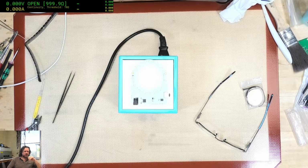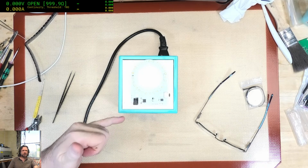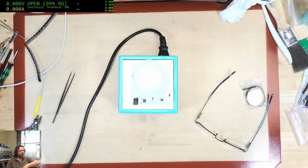Yeah, most plastics. Actually, I can't think of anything off the top of my head that is not reflow rated. But if you take your hot air wand, even at say 250, and you focus it on one of the corners, then yeah, that will melt. Consider it like this, it's equivalent to what you think of as the wind chill factor, except it's more like the hot burny factor.